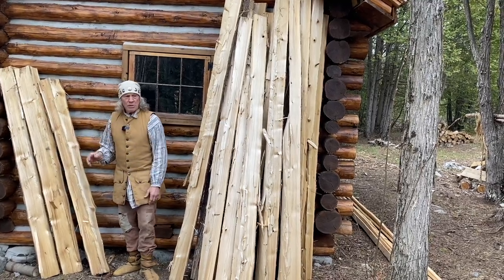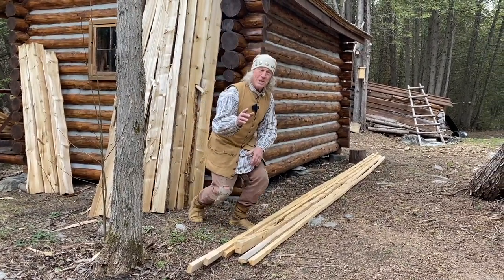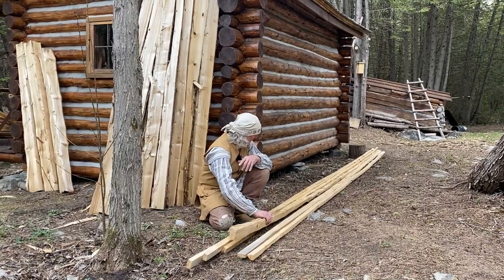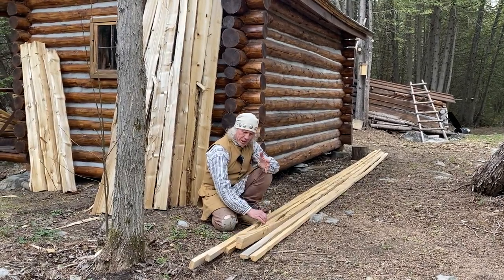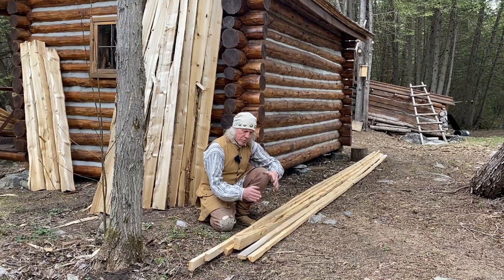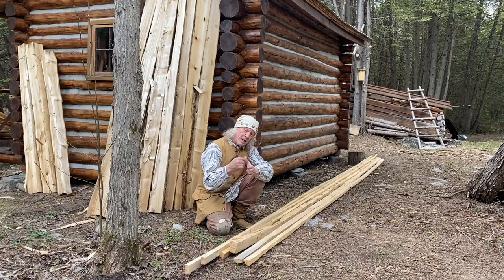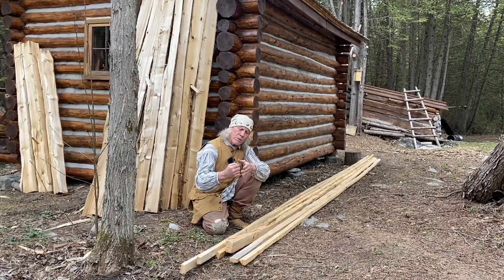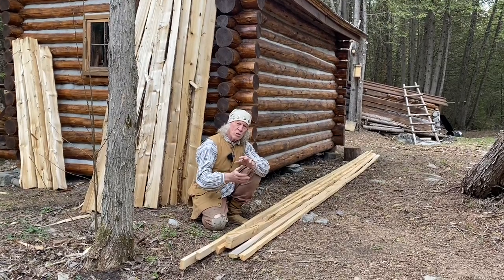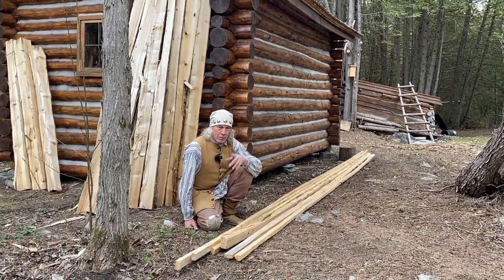So I've got a few shaped out here, and I'm going to actually draw one out. Oh yeah, just before I get at shaping out my first piece of sheathing, I've roughed out my gunwales and my gunwale caps. So it takes three pieces per side. They're pretty crude at this point. So you've got an inner gunwale, an outer gunwale, which sandwiches the bark between the two, and then it gets laced between the ribs the length of the canoe. And then it'll have a gunwale cap, and its sole purpose really is to protect the root from damage from the paddler as he's paddling. Anyway, that's another day I'm going to get out a piece of sheathing.